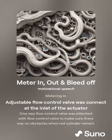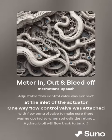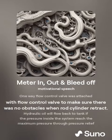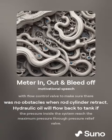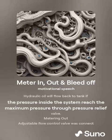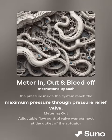Meter-in: the adjustable flow control valve must be connected at the inlet of the actuator. A one-way flow control valve is attached with the flow control valve to make sure there are no obstacles when the rod cylinder retracts. Hydraulic oil will flow back to the tank if the pressure inside the system reaches the maximum pressure through the pressure relief valve.